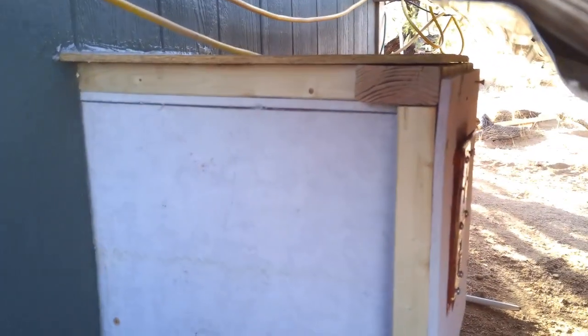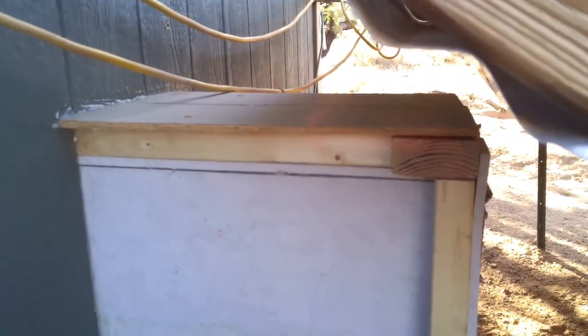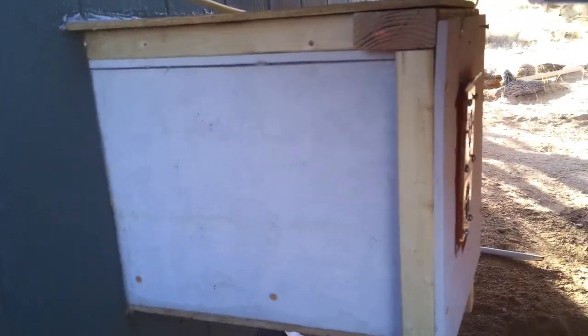But I got it done. This is cement board — non-burnable. I had exactly 12 inches width to make that box, and it's about 12 inches wide. The studs on the inside, tops already done, insulated in there and everything. I still gotta build a support network for the insulation going on the side, the bottom, and the other side. Hopefully there'll be enough room for the heat to come out and waft up. I'm not going to be storing my gasoline here. That took me two full days.